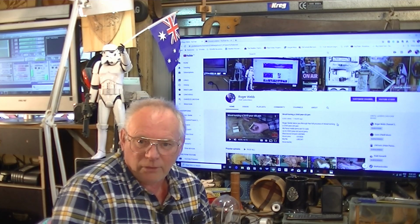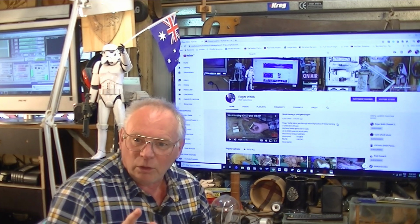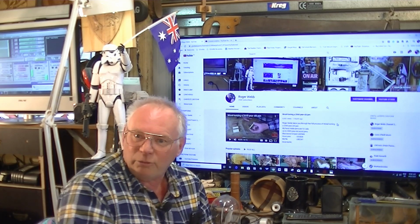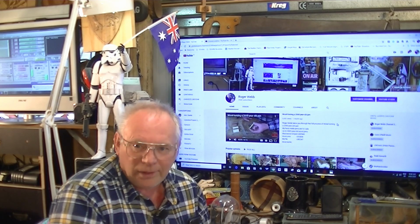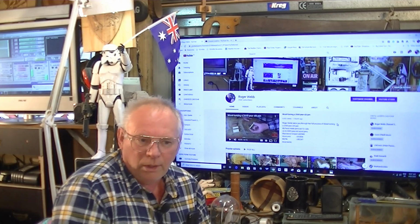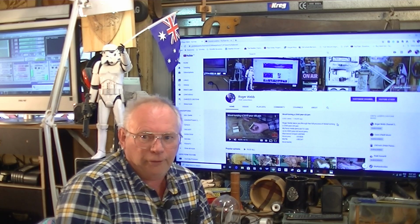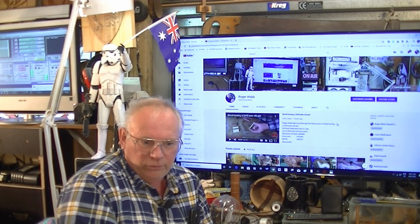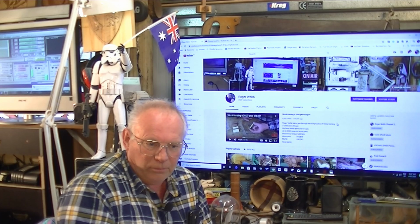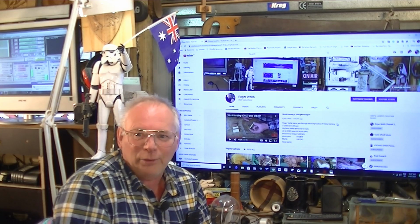I would advise, if you were buying a CNC router, that you would want it to work with Mach 3 with the USB connectivity. None of this 25 pin port business, because that's old XP. And another thing I would advise against is any program that they try and push on you. I mean, I started off with NC Studio. That's what the machine came with, and I very quickly learnt that, well, I regarded it as not very good. In actual fact, the CAD wrecked 2 computers for me before I found out that that's what was doing it.